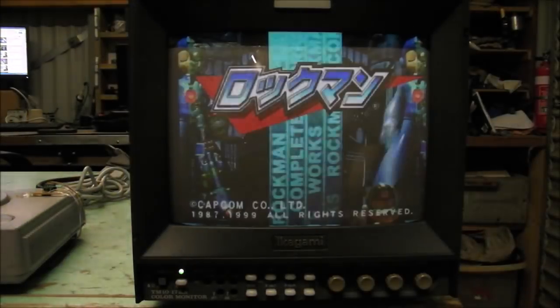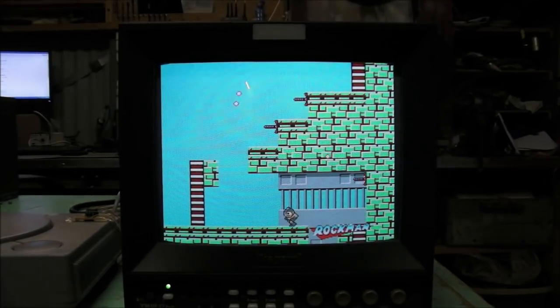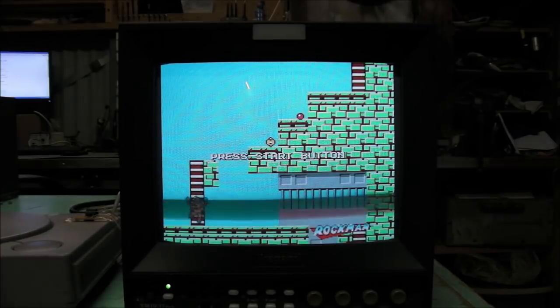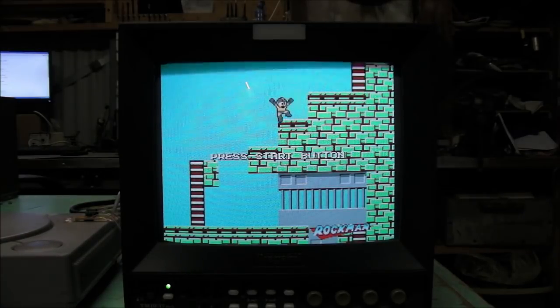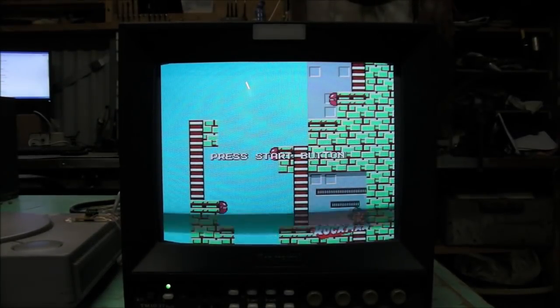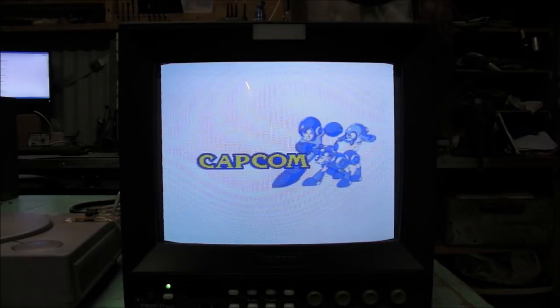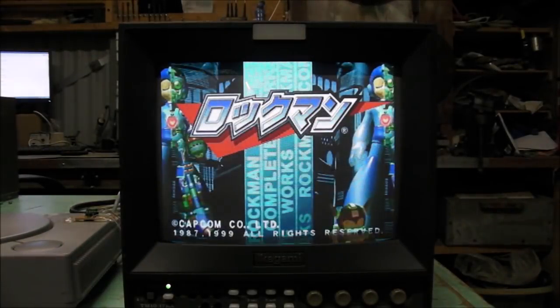Anyhow, I'll see if I can shift the picture across. Well, I centered the picture. It's pretty close. It's better. There's an H-phase trim pot that does the job. I really need to expand the horizontal width now, but I don't know which trim pot does that, and I can't find a service manual, so I'm just going to have to ignore it for the moment.